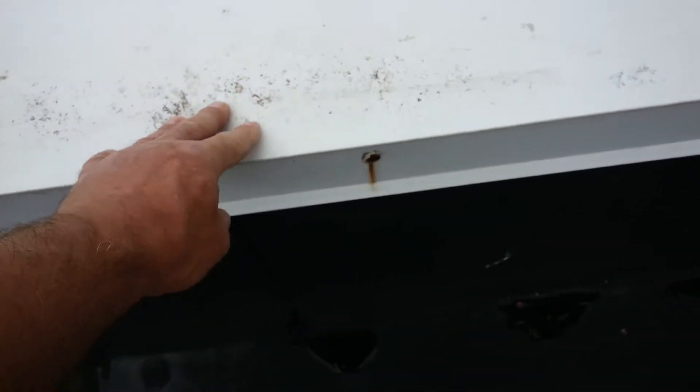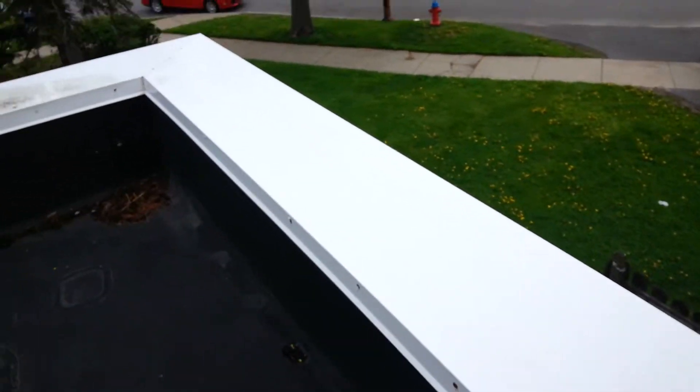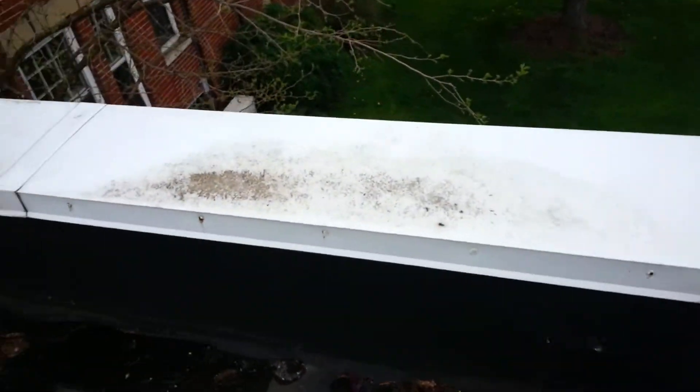This is directly over the door. You can see this water line here — it comes up underneath that cap flashing. There's no seam here, but that tells me that water's getting under here and traveling. Water's coming in from either that seam or that seam, so all of these seams have to be sealed, and that will arrest that water from coming in up above.